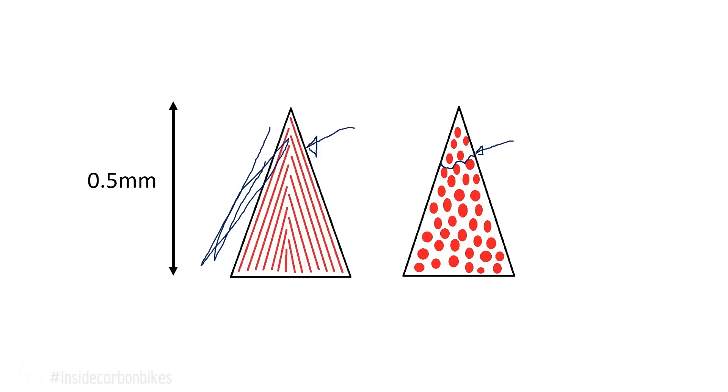Because the resin is only about one percent of the strength of the fiber, when load comes in from the side you'll just get a crack through the resin between those fibers. The tip of the thread can just shear off. You also won't be getting any fiber right up into the corner at the root — that'll just be resin. So it's going to be very difficult to get good structural properties out of the thread tip, and it's highly likely the tip can shear off and get damaged quite easily. There's really no way those threads would have had fiber placed in them properly.